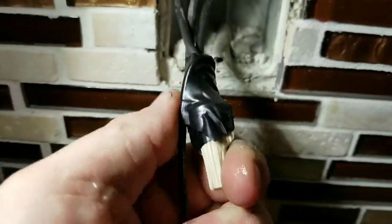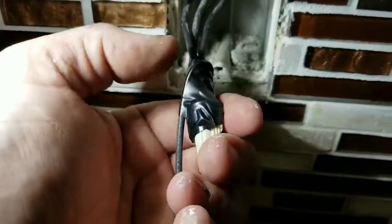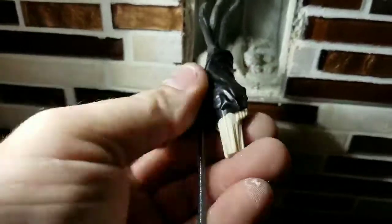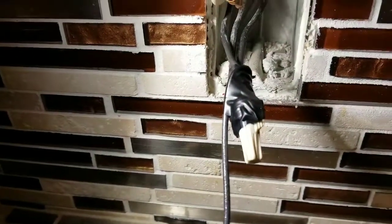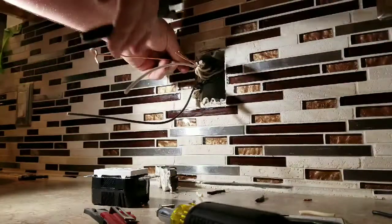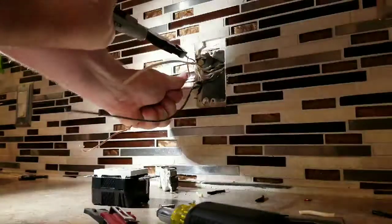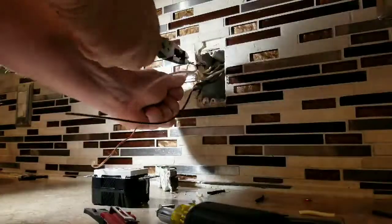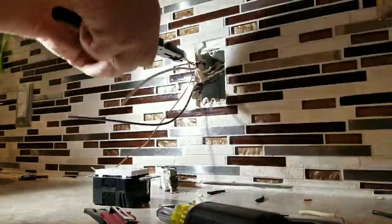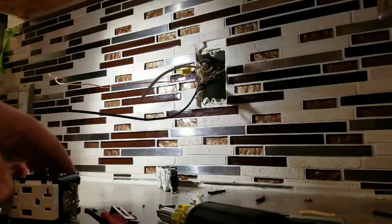When taping, you want to go around the nut and anything protruding. This one is going to my outlet, but I don't want anything going in to where the nut's covering the wire, so I cover that completely. You can't be too safe. I'll show you how I basically twist the ground wires together — pretty simple. Having a flat linesman plier, a wide nose really helps with this. Just grab it and you twist. The wide really helps grabbing onto wires. It's still going to be a little tricky, but this helps. Needle nose is really hard because you can't grab onto nearly as many wires. My wires are all connected. I'll push everything in, get everything situated in the box, and then cut these to length to put onto my new outlet.